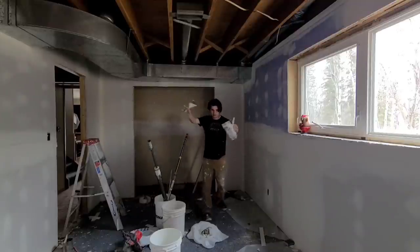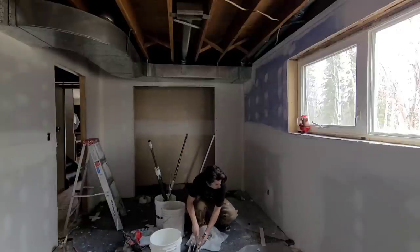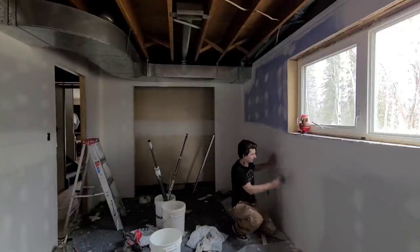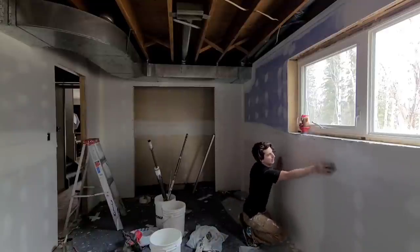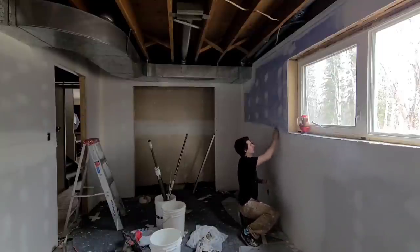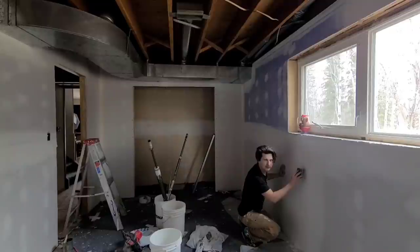After you would complete all of that, because those take the longest to dry, you want to do them first. Move on to what else needs to be skimmed out. In this case, it's our butts. If there are any ridges, give them a sand. Normally you would use a pole sander for this, but I left mine on the job site that I'm currently working on. Intermediarily, in between other things. There you go.